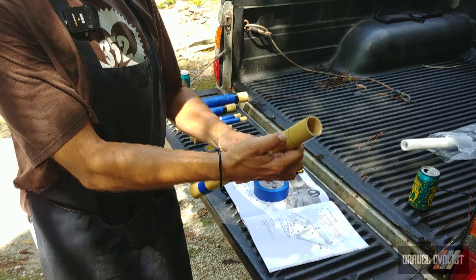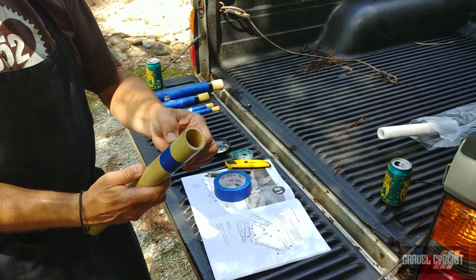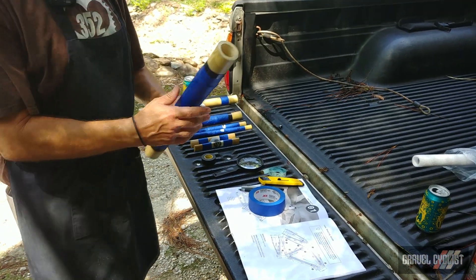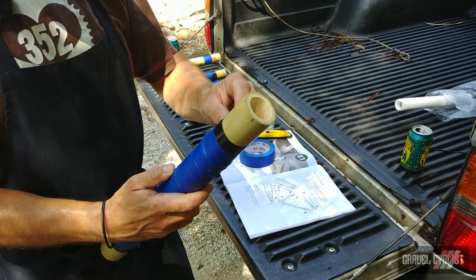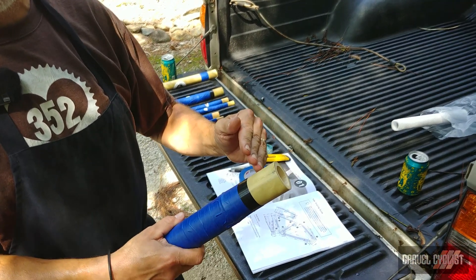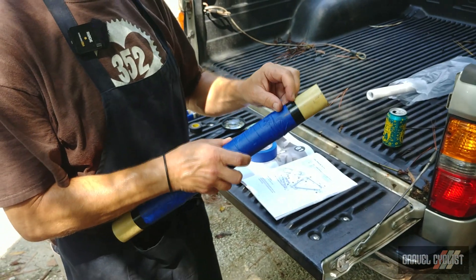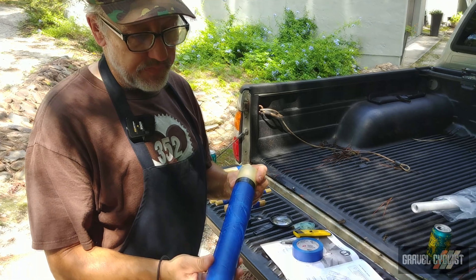The first thing is to do that measurement and then make your line all the way around. The second step is to mark with painter's tape right on that line — that's going to be your determined marking of where you'll eventually be scoring and shaving. After that, advice in the manual which I did read is to put several layers of electrical tape at that same mark level all the way around. What this does is build up the surface a little bit and kind of gives your knife an edge to work against. When we start in the next video, the first thing you'll do is score a line all the way around on each tube.